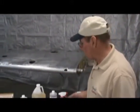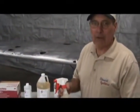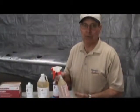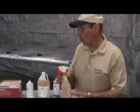We are going to put the aluminum etch on. Since this is a used wing, we have diluted this one to one — one part water, one part etch. If it were a new aluminum wing, new metal, we would dilute it two parts water to one part etch.